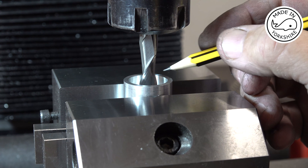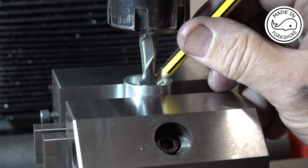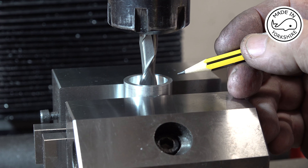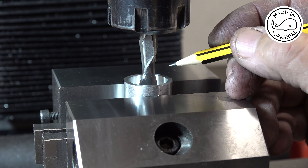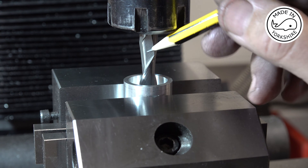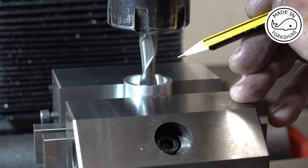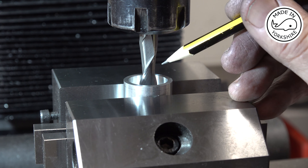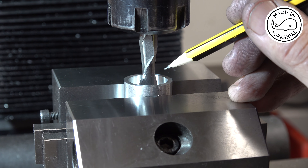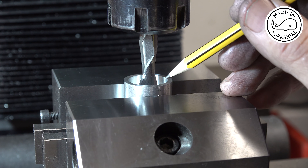By positioning the milling cutter on this edge and then on the inside, I've measured that distance to be 0.362 of an inch. The drawing states it should be 0.375, so I've not machined it very accurately in the lathe. What I need to do is machine out from this top edge down to a depth of 0.8. With it already being 0.362 machined out, I take 0.362 from 0.8 and get 0.438, so I need to cut down to 0.438 initially.